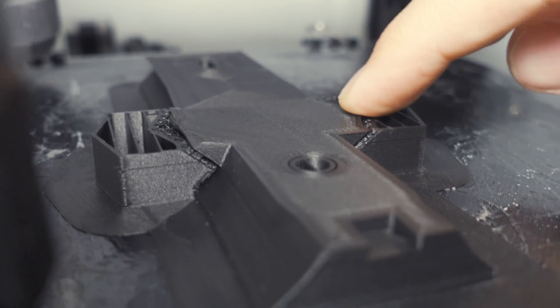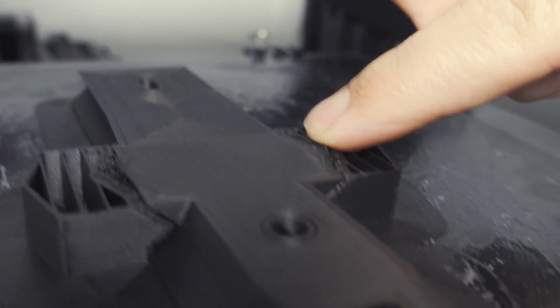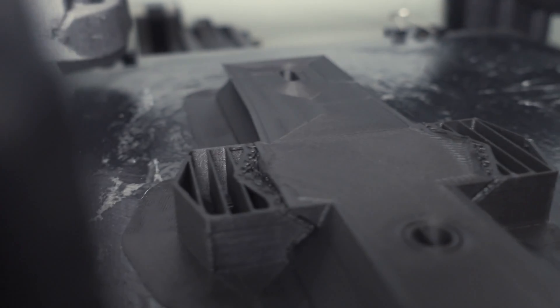So close - this is quite a difficult problem. Overhangs are when the extruder prints over nothing, so you have to print a support underneath. The overhang is warping up as it's printing and not connecting to the support, so I decided to quickly try a different type of tree support and run it again overnight. We're going to have to wait about 10 hours and see if this thing works in the morning. Fingers crossed that this is the one.